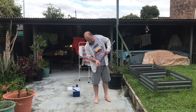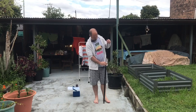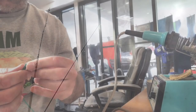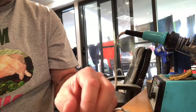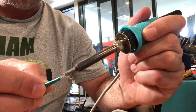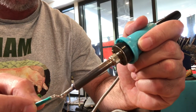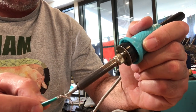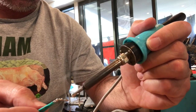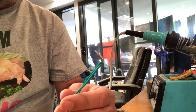Let's get this up in the air and see how high it goes. That is our squid pole. That half wavelength antenna, because it had such a big loading coil on it, was quite a bit shorter than the required 66 feet for 7 megs halfwave, so we've had to add a little bit of wire. Ideally you'd measure it, adjust, and cut a clean single piece of wire — but I'm not that OCD about it. We'll get this soldered and taped off, then set it all up and get it on the Nano VNA to see what adjustments we need to make.